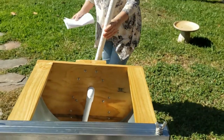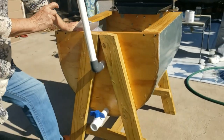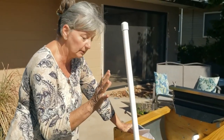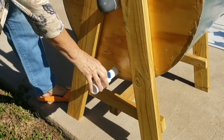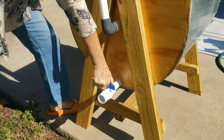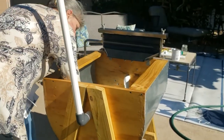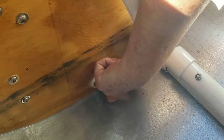Instead of trying to do a hole in the bottom of that sheet metal — which is tricky — I went ahead and just put a PVC through the side here, then put one of these little ball valves on it. You just open that up and the water comes out. It's not one of those little skinny things — it's huge, it's going to let the water out really good and fast. Just a ball valve and a piece of PVC coming through. I let it come out just a little bit, about an eighth to a quarter of an inch, and then put a nice coating of caulking around it so that water just goes through there.